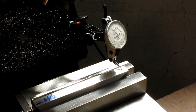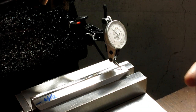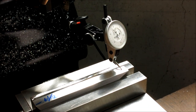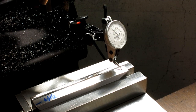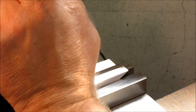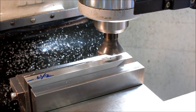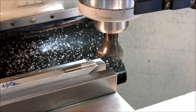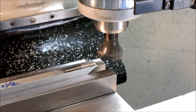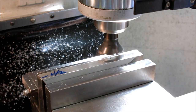I don't have a sine bar under it right now — I knew what I wanted to do with that surface, which was kick that up, mow that off, which brings that angle in. I don't want the sine bar in there influencing me with that. I happen to know that that EDM sine bar doesn't agree with my other sine bars by a little bit. For shop grade work it doesn't matter, but for this kind of stuff it does matter. So that's what we expect — just to fade out. What a beautiful thing.